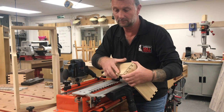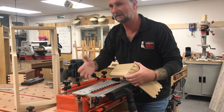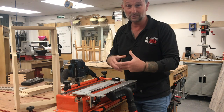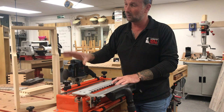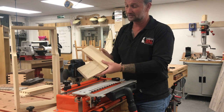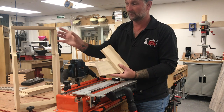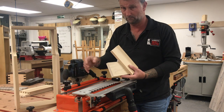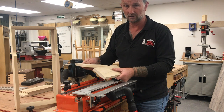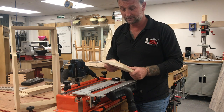And we're going to go through step by step. There's a lot of dovetail jigs, and I think, to be honest, most dovetail jigs work in this way. This one's, you know, a little bit better, of course. But let's look at step by step. Now, firstly, I'm going to do a test piece before we get into our actual final piece, material that's the same sort of width. We're dealing with 16mm and 18mm, so 16mm for the sides, 18mm for the top and bottom, and of course we've got a slightly different width on the top than we have the bottom, so we'll consider that as we go through. But I've got material of equal dimensions, just to do some test cuts, to get the fit just the way we want it. So that's what we're going to do first.